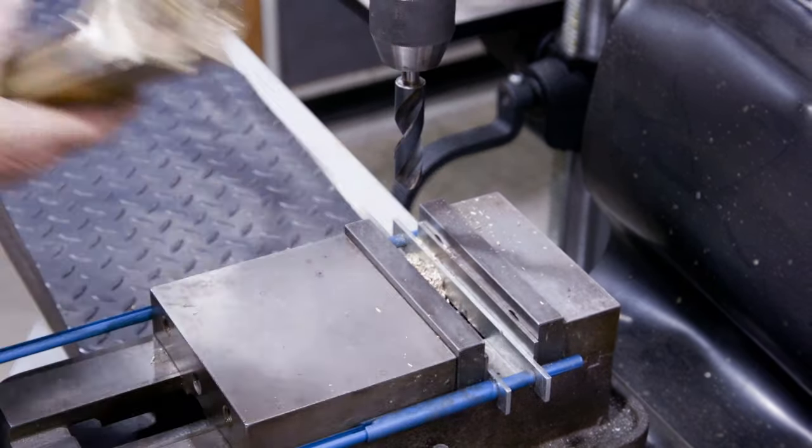I just took all these bolts over to the lathe — took about sixty thousandths, a couple two or three passes to bring it down. That worked out pretty good. Just like that and then a little chamfer on the end to give it that bolt look. I'll do one more close up so you can see how that works — a couple of passes around sixty thousandths or so, then the chamfer. Those are back in place and now the ring gear sits perfectly flat. That glass is going to work well.